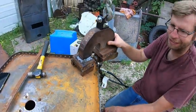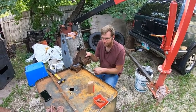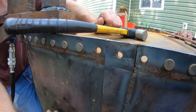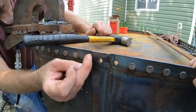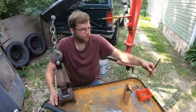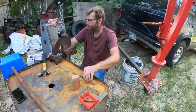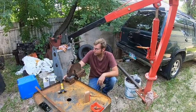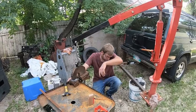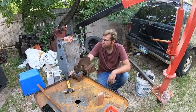So that's hydraulic riveting. These are off a 1912 — I can't remember if it's a 17 or 20 horse George White — made in Ontario, I think London Ontario. All that's left to do on this tank is I have to modify the stiffener rib here: mill off my little dies a little bit on one side, flip it rather than doing both, put a slightly longer rivet in, then cut off two straps and change the threads out. Those hold it down to the floor. These things are ready to be blasted and painted — I'm assuming they're going black. That other tank is going to suck a little more because the middle row we've got to do with an air hammer — not worth making a throat that deep just for one job.